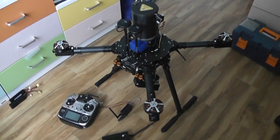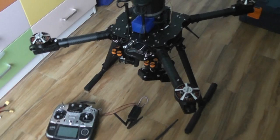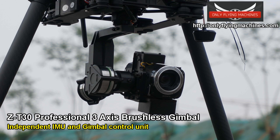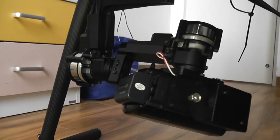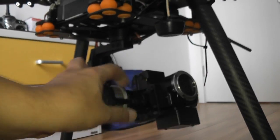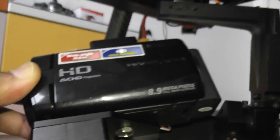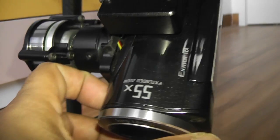Now let's take a look at the camera gimbal and the radio system, its switch assignments, and how the single operator system works. The gimbal is a 3-axis professional brushless gimbal with 360-degree pan, 360-degree roll, and 360-degree tilt — though you won't want to do full roll or tilt in normal use. The Sony CX270 with 30x optical zoom is supplied, and it also has 55x total zoom using the intelligent digital zoom.